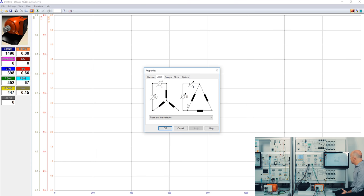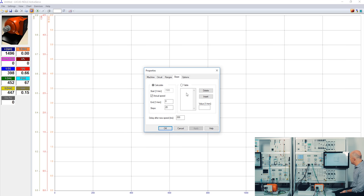I can define my ranges and slope — I can type in a specific starting point or set up a table of values to record. For safety reasons I can also set limits such as a lower speed limit, an upper speed limit, or a maximum torque.